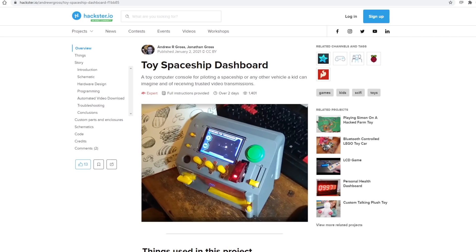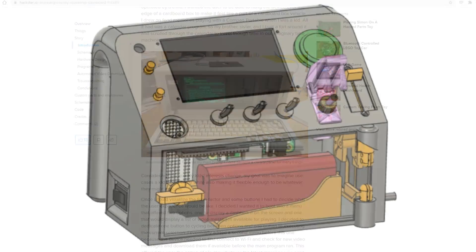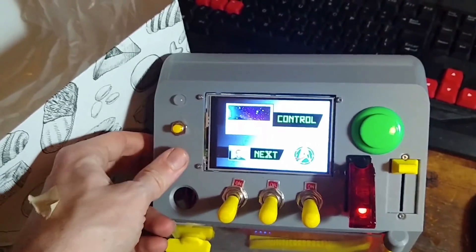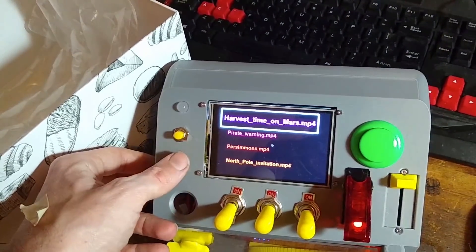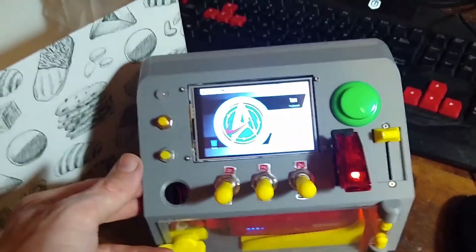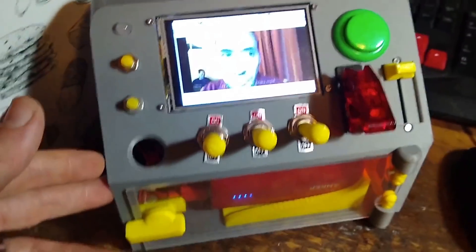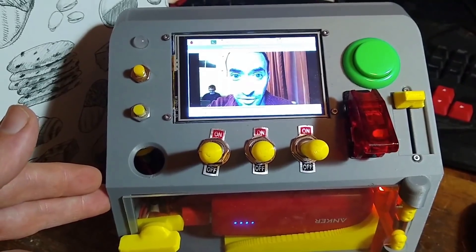The second project is a Raspberry Pi controlled spaceship dashboard for kids inspired by an old compact portable computer, built for Andrew's 4-year-old niece to add to her cardboard spaceship. The control panel has a 7-inch screen, various control switches and buttons, NeoPixel lighting, and a speaker. The majority of the code is Python using Pygame for graphics and interaction, with assets created in GIMP. Video can also be played, which the device automatically downloads from a Google Drive location on startup — meaning you can effectively send video messages to the device by uploading them in advance.